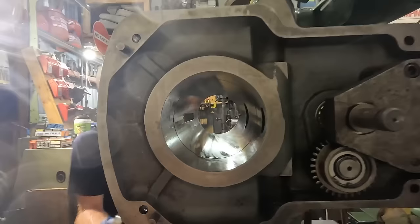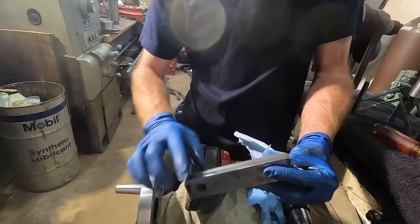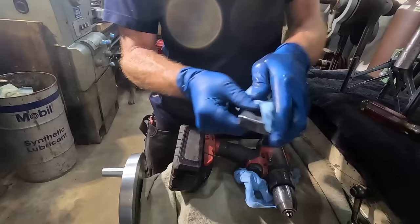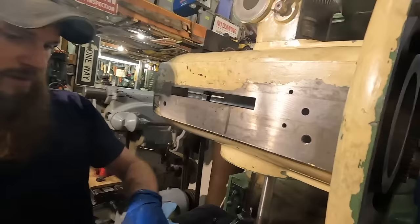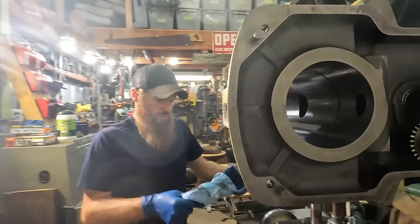And as you can see here, this block that I made, I just did a real gentle V, or kind of a rounded edge, on the 2x72, just on one of the rollers. It's not perfect, but it kept us from breaking the stone and falling into that gap. And that was the whole point. And now we were able to get all the way through it in one pass without having to come from the other side. I'd rather take less out than more and then work our way towards whatever, so.